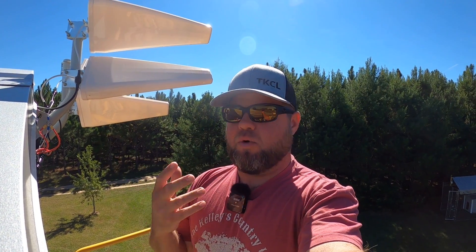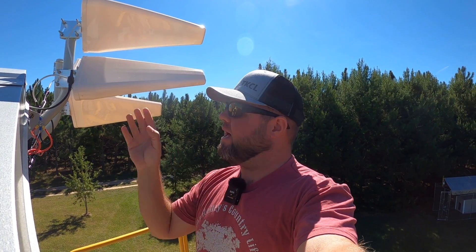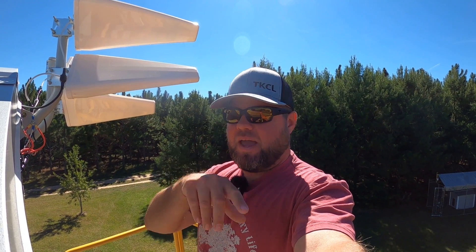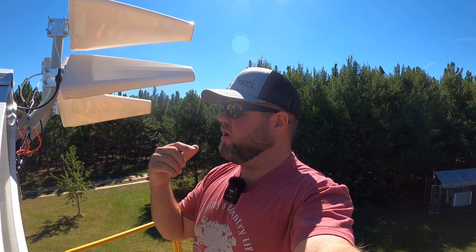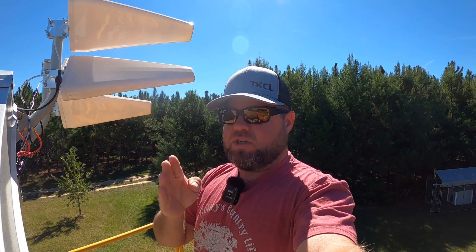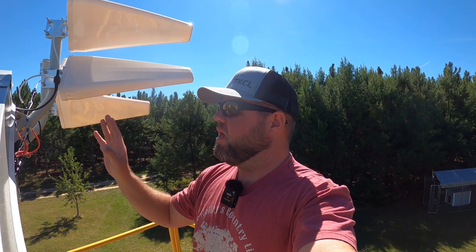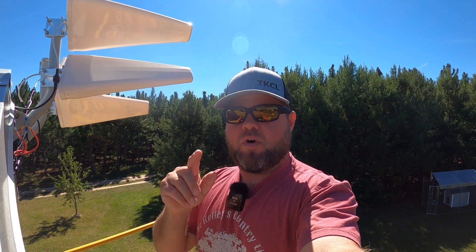These are also a higher gain and more amplified antenna. So long story short, in theory — and I'm going to regurgitate some stuff that one of the representatives from Waveform told me — if you are willing to spend the time to properly aim these, you've got to know exactly where the tower is that's servicing your SIM card and cellular plan. There are links down in the description for cell tower locations. You need all four pointed toward the same direction, and you may have to adjust up, down, and left and right — we're talking 360 degrees. These have a greater chance of giving you more amplification, but they require more effort on your part.